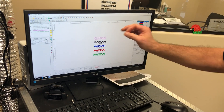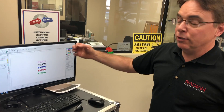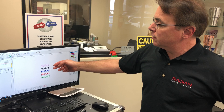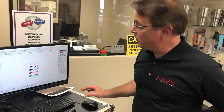All the colors are doing is indicating different pens, and all the pens mean is that I have different laser parameters set up for each one. I'm going to do everything from just an outline to different types of marks — from a white mark to a heavy engrave to an anneal. You'll see a variety of marks when we're done.